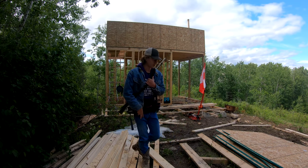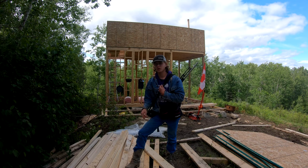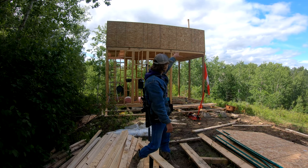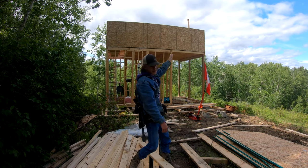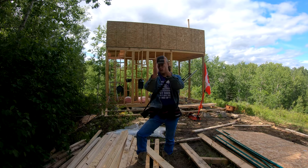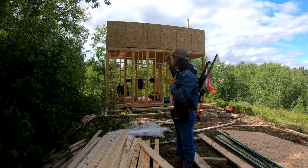If you have an extremely moderate pitch, your rafters are going to be weaker and you're probably going to have to consider laying a ridge beam where the beam is underneath the rafters and the rafters bolt on top. I've got to build triangular walls on the front and back of the cabin — I'm going to put my two windows on the front, and my ridge board support will sit on top of there. Two windows on the front.